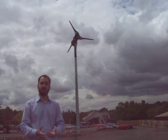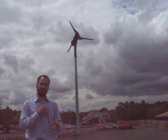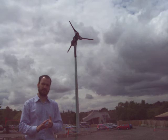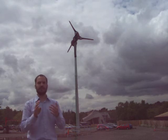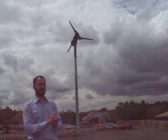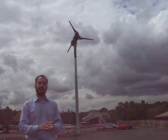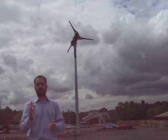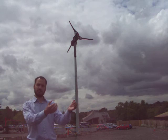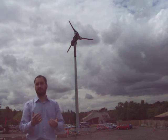It's very important that the wind turbine is put in the windiest place possible. That means you need to have the wind turbine in a place where there's a clear fetch in as many directions as possible. A clear fetch means no obstructions from the direction that the wind is coming in — so buildings and trees — or if there are obstructions, try to raise the mast up to lift the wind turbine into air flows which are clear of those obstructions.